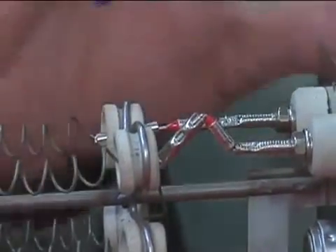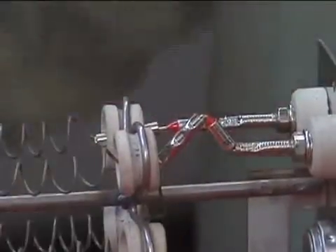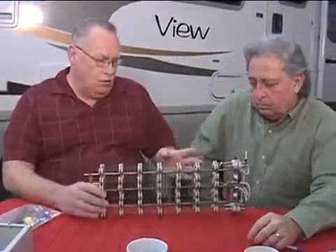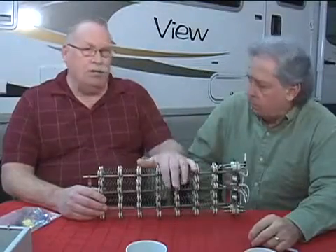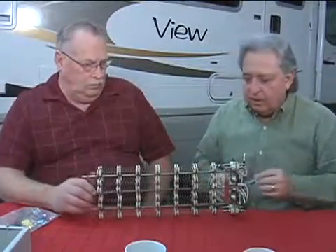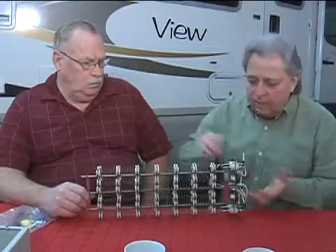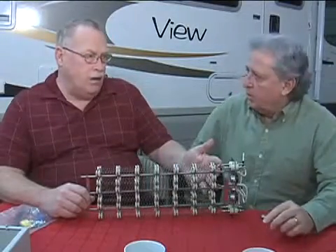The fusible links are not resettable. Once they burn through and they're gone, this unit has to be sent back and the entire coil assembly has to be replaced. The method to the madness is: if you close off all the registers, if the fan fails, if anything goes wrong, these things are going to burn through internally and they won't cause a fire. Redundant safety features means that for end users sleeping at night, it's not going to be a concern. This actually has more safety features in it than a gas furnace does.